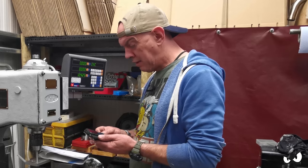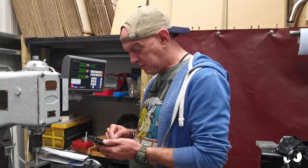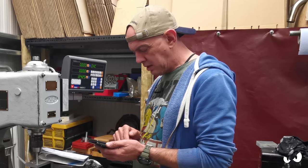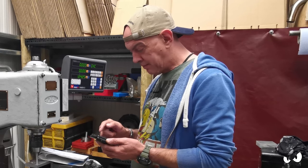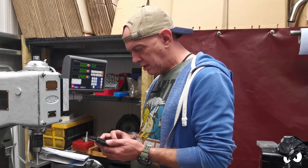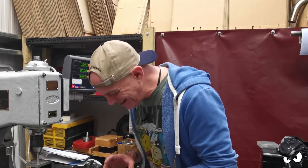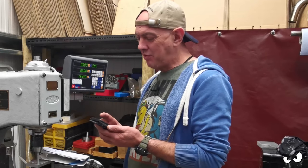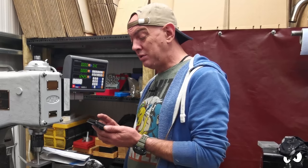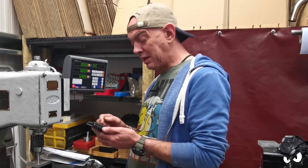And then there was another fella. I want to say Phil. Was it Phil? He just went, yeah, you done it wrong. I want to get his name. Yeah, Philip Kawasaki. He was really good. He was dead blunt. Dude, you done that wrong. You have compensated for nothing in your demonstration. Your DRO now reads 270 when it is actually 270.29. Basically, you're still out 0.29. You should have had to go to 270.29 to get your dial back in the hole.